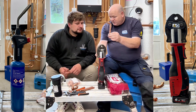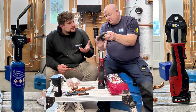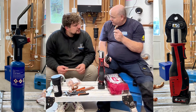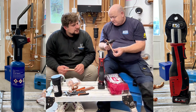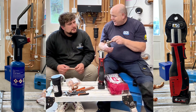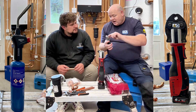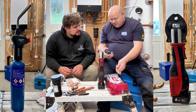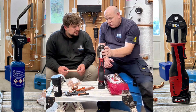You've got to make sure you get the right fittings for the right jaws. These fittings are for an M-pattern jaw. There are different brands that still use an M-pattern jaw, so you've got to make sure you get the right jaws for the right fittings. There are quite a few types — I think there's V as well, but I've always had M so I don't really know the difference. You've also got to make sure the jaws are in good condition. You can get a lubricant to put in there that stops it jamming or sticking when you press.